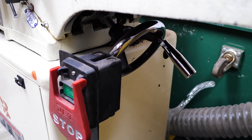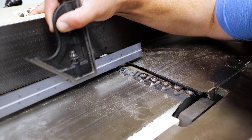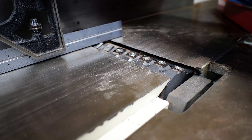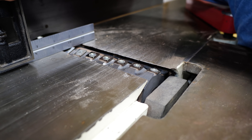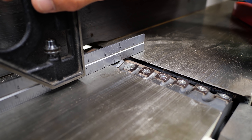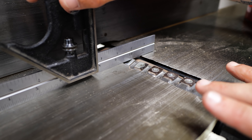It's very simple. There are two hand cranks here that raise and lower the infeed and outfeed sides. The outfeed side, once you set it, you're going to set it and forget it. What you want for your cutter head is it needs to be just a hair higher than your outfeed table. You take your largest known straight edge, place it on the table, and your cutter head should just barely come in contact with it. At its very highest point it should just barely move the ruler — right there is perfect.